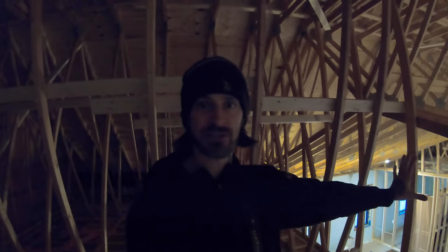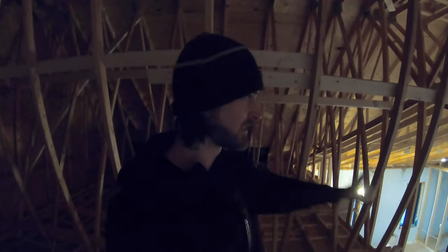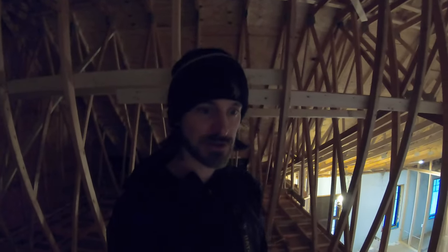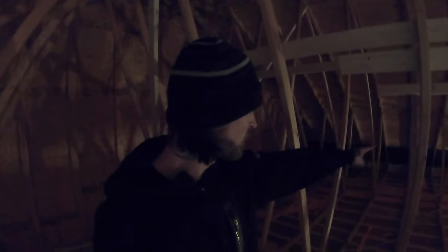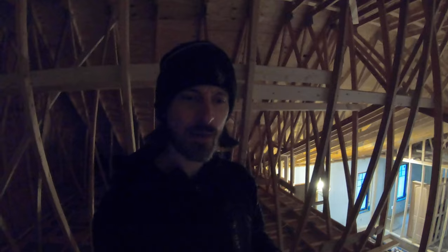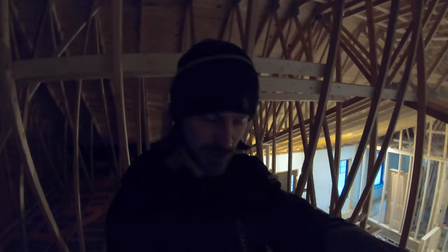So that way we achieve an R60 coming out here, but the spray foam won't be that expensive because we're only dealing with these little triangles here and the triangle over on the back side of the master bedroom wall. But we'll have to have them maybe come out and give a quote, because they could also maybe spray foam all of the eaves down over in there and down along where any of the triangles come together. So that way we're not trying to blow insulation down into those cracks.